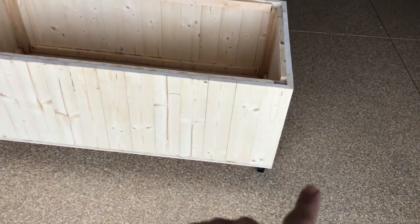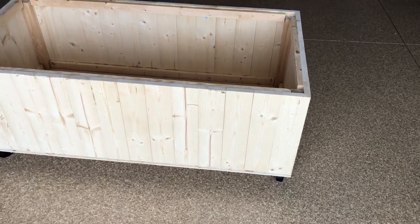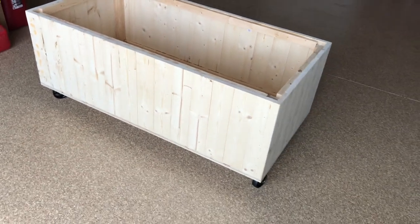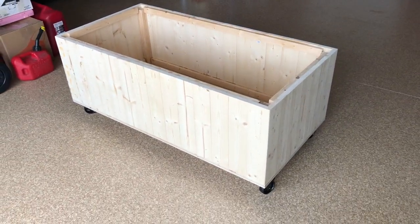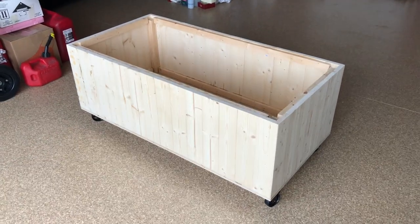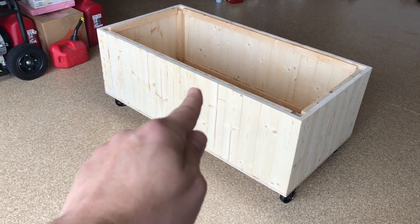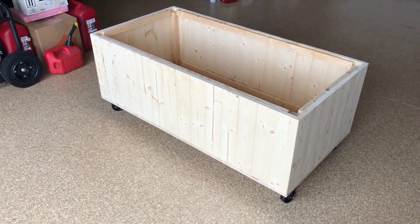So really, all I'm gonna do at this point is put some decorative trim along the top and the bottom. I went ahead and grabbed some 1x3-inch boards by 96 the other day while I was out. I'm just gonna run one of those across the top, one across the bottom. Now you could get fancy here and put a board through the middle and then do the diagonal board like that to give it a farmhouse look or whatever.